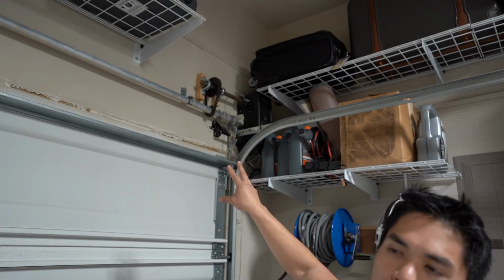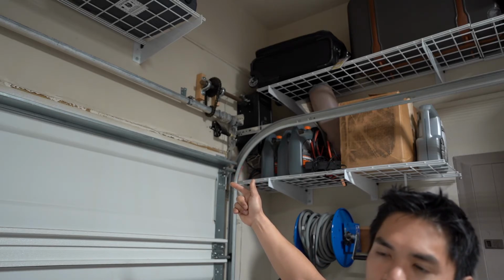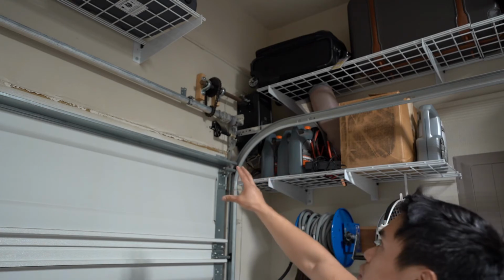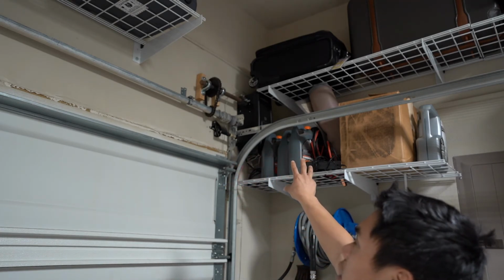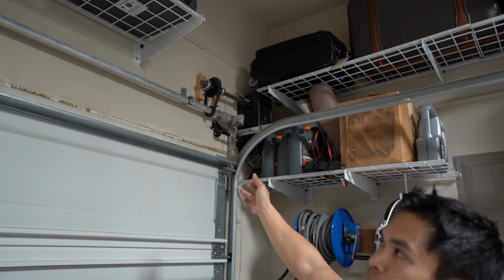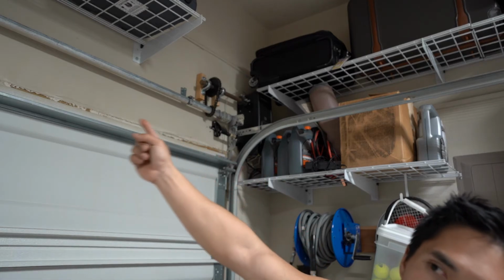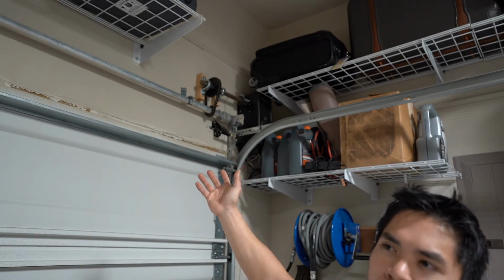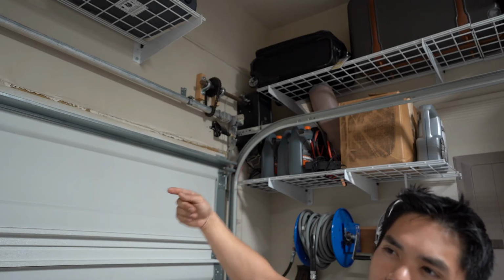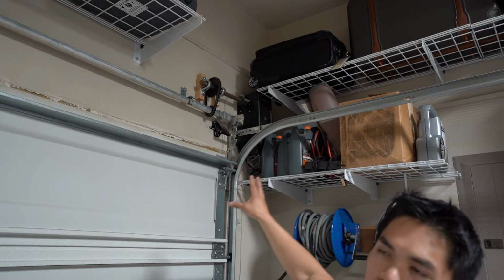There's a guy on YouTube who, I forgot his name. I can put the link in the description if he's still doing it. But 2 years ago, there was a guy on YouTube who specifically sold that kit so that you can convert the side-mounted garage door opener to work with the Wayne Dalton Torque Master. Alternatively, you can change the whole thing out and just get rid of the Wayne Dalton Torque Master, and I believe just change it to a regular spool reel that opens and closes the garage. So it's totally up to you, but that's what I had to do to modify it.